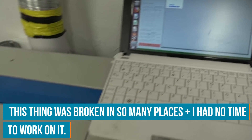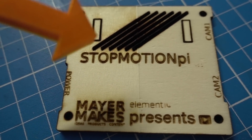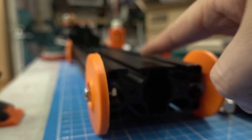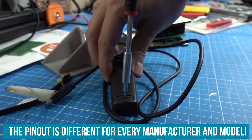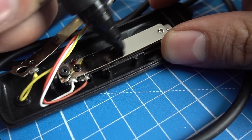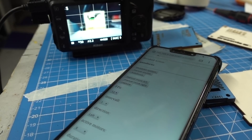So we have the hardware, the assembled PCB, and the code. All we need is the physical build in an enclosure. I recently got my tiny laser cutter to work, so let's laser cut and partially 3D print an enclosure. I also 3D printed some wheels and stepper motor mounts, and fixed all of that onto a piece of aluminium extrusion I had laying around, to form some kind of a dolly that I can mount my DSLR camera to. I also had to make a cable that connects the Raspberry Pi to the camera — I used a cheap remote for my camera, which is manufacturer-specific, so I got a Nikon remote and modded it by connecting the cables to the right pins on the connector. Now we can do our first test run.